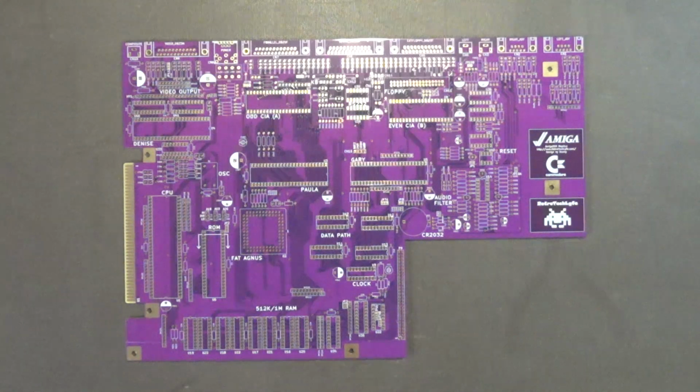I actually read the spec sheets from several manufacturers, and they all said the same thing. These are not designed for integrated circuits. If you use them for integrated circuits, the mean time between failure rating on these machined sockets is 10. That's right. So that right there proved to me that I was correct when I read that. But don't take my word for it. Do your own homework. I always recommend that people do their own homework. Don't take my word for it. Do your own homework. Okay.